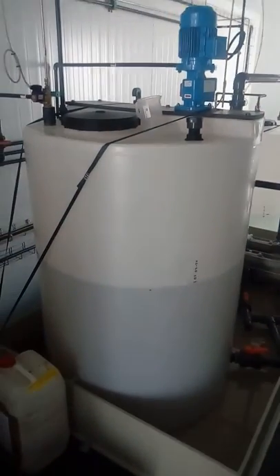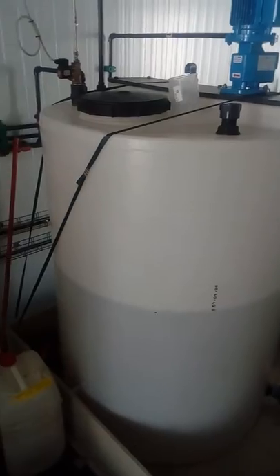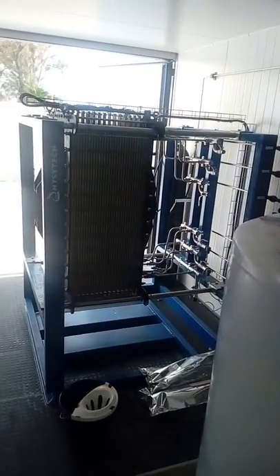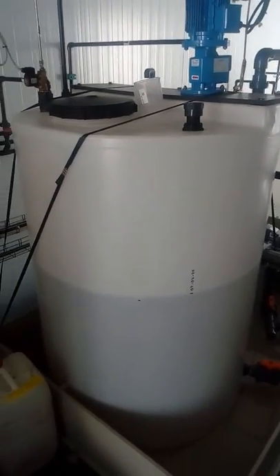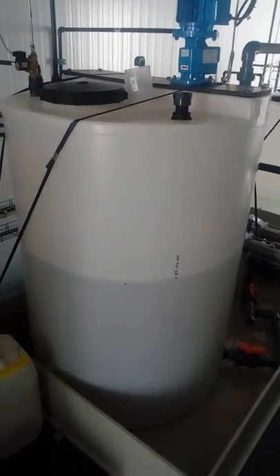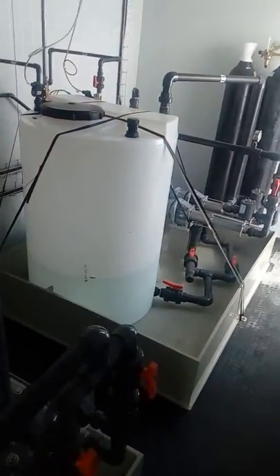You can see the difference in color because in here the bacteria has been inoculated, where the organic matter is and the bacteria is growing, pumped inside the cell where the biofilm is going to be developed, transferring the electricity to the wires and generating an electrical current which will produce the desalination of the saline stream.